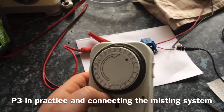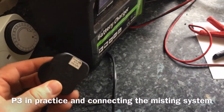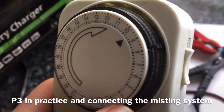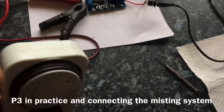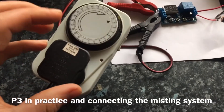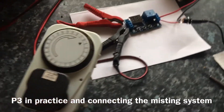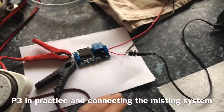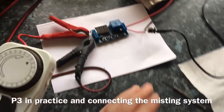To explain the combined system: this is the power supply to the cycle relay. We put this into the manual analog timer and it can time in 15 minute increments. We've selected it to come on at eight o'clock for 15 minutes. You're probably better off using a dual block plug adapter so you can insert both the power adapter to the misting system and the power adapter for the cycle relay to come on at the same time for 15 minutes. You'll have this already set so it'll only come on for the amount of seconds you want, then choose 999 seconds for the off period, and as soon as the 15 minutes runs out it'll turn off anyway.